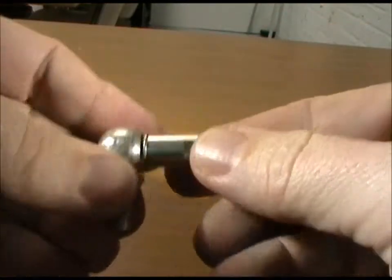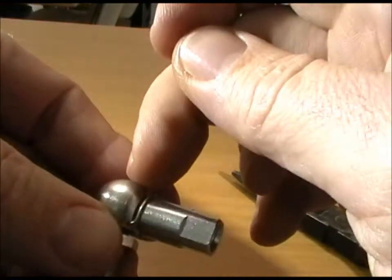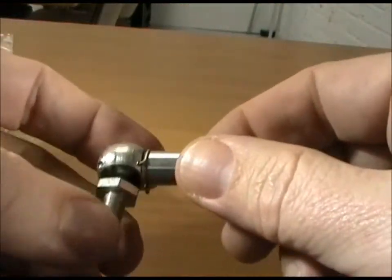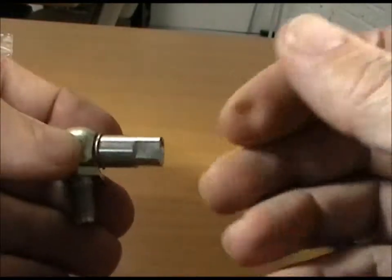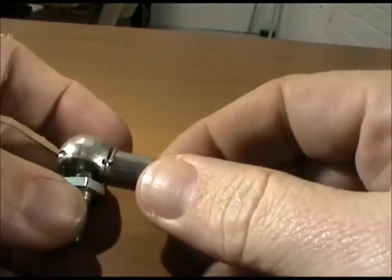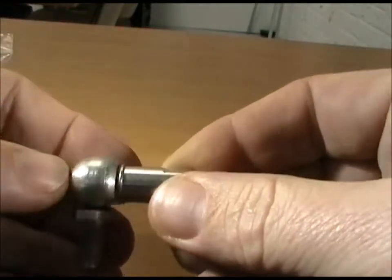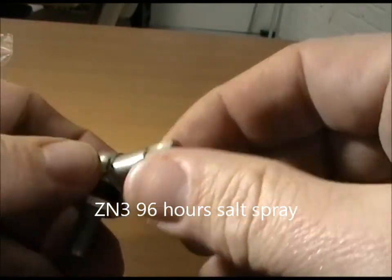The standard range is 25mm from the end of the body to the centreline of the ball pin. These are also available in a variety of different lengths and different finishes — we do silver and black. This one is silver, zinc and trivalent passivate.